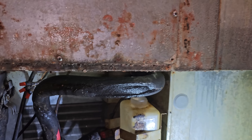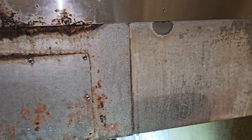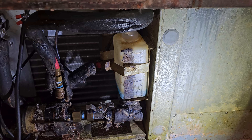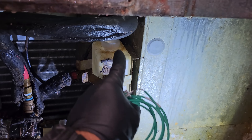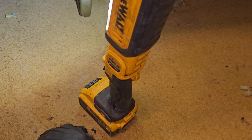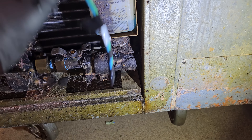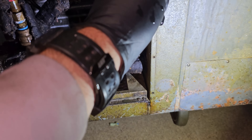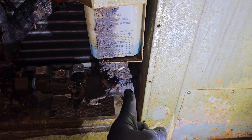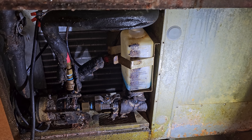There's no easy way to run new sensors because they're encapsulated from the front in the box and run through the walls to the back. The manufacturer actually tells you that if you need to change sensors, you retrofit them and locate them in the glycol — both the blue and the green sensor. What I typically do is take a zip tie as a straight guide and tape the sensors to it. You have to make sure it goes all the way down into the flow, not just the reservoir. I mark it so I know when my mark reaches the top that it's seated properly. There's a 3/8-inch hole at the bottom and you have to feed it down into the T, all the way into the flow.